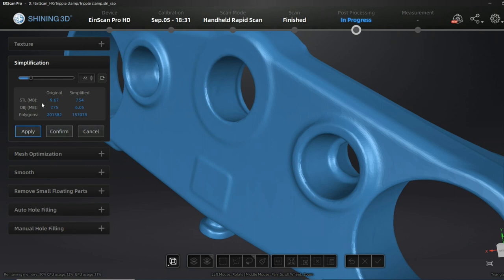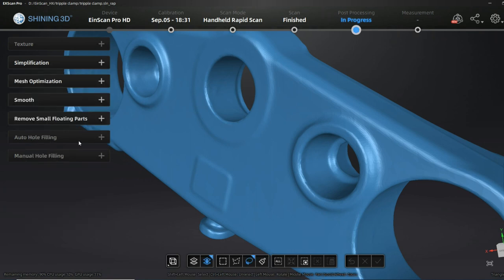Applying about 22% simplification creates an STL file of around 10 megabytes — not much bigger than a normal photo on your mobile phone — and that's absolutely fine. Holes filling speaks for itself. Manual holes filling means selecting areas you want to close in a non-watertight model. For more detail on these mesh operations, refer to the EinScan HX videos which cover mesh, remeshing, mesh treatment, and merging.